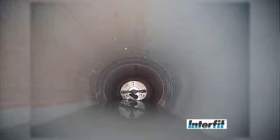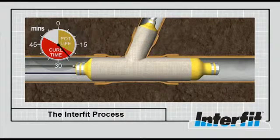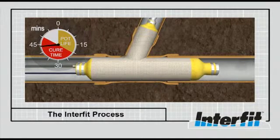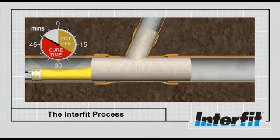At this stage, between about 8 and 14 minutes will have elapsed since the resin was dispensed, well within the 20-minute pot life or working time. The packer is now held in position for a further 30 minutes — that is, until the total time elapsed reaches 50 minutes. At this point, the resin will have fully cured and the packer can be deflated and withdrawn, leaving behind the final product.